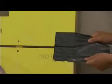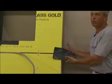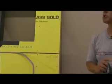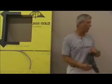That way, if you get expansion in that joint, it can stretch. This flashing tape has a memory to it — it'll pull right back to its original form. If you use this product, the backstop has to go on first — no options. It has to go on prior to the application of this product. The nice thing about the AquaFlash is it can be applied either before or after.